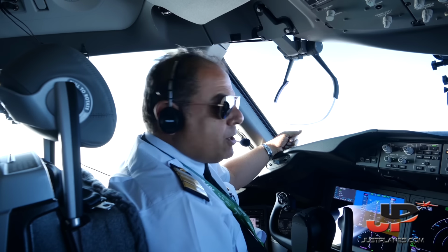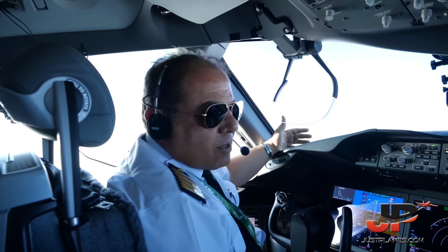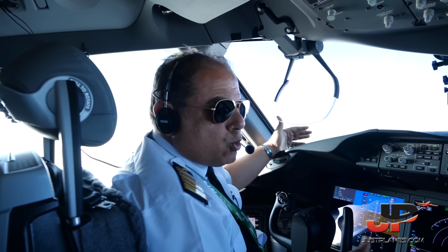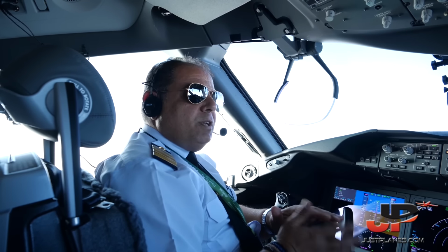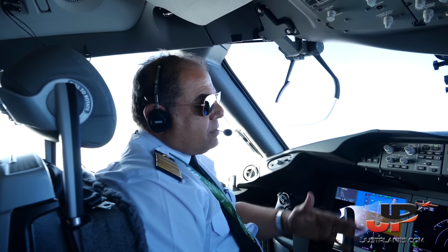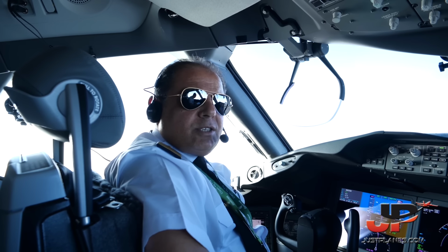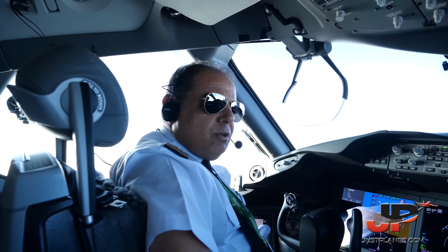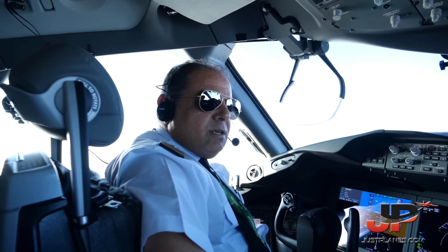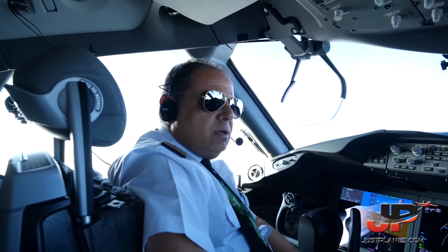We have something called the cruise flaps. Flaps and ailerons and other flight controls keep on moving during cruise to increase the wing camber, so it decreases drag, increases altitude capability, and reduces power, thus reducing the fuel flow. We have another state-of-the-art air conditioning system. It does not extract any bleed from the engines, so engine thrust is purely thrust. The air conditioning system relies on electrically operated cabin air compressors.